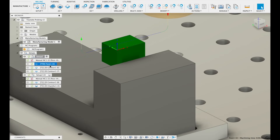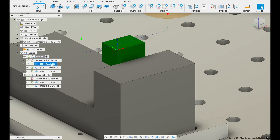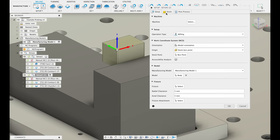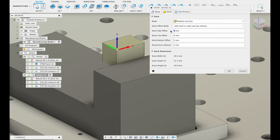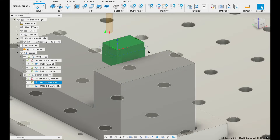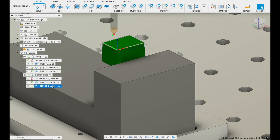Now in this precision test we first face off the part. After that we mill an outer contour with a 6mm two-flute end mill, and then we do another spring pass before, in a second setup, probing the milled corner again and checking at a different height — 5mm instead of 10mm — to see if there is any mismatch or precision failure between these two contours.